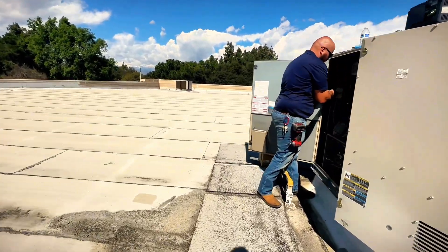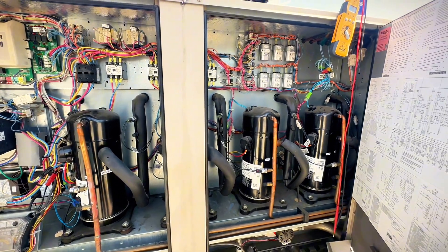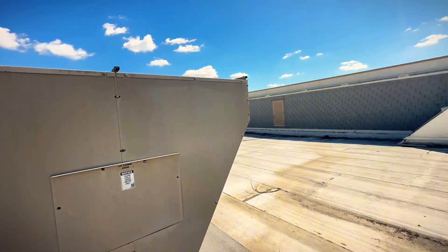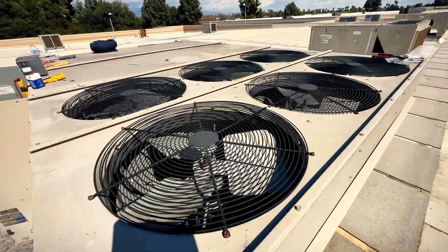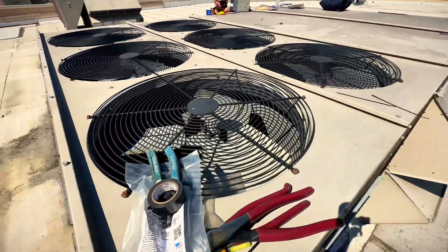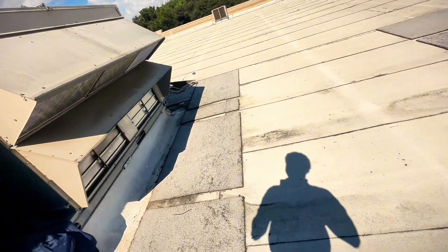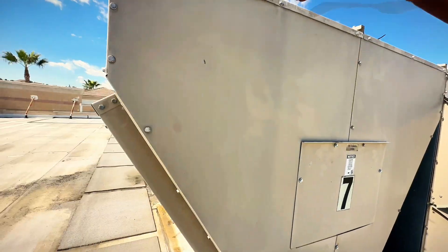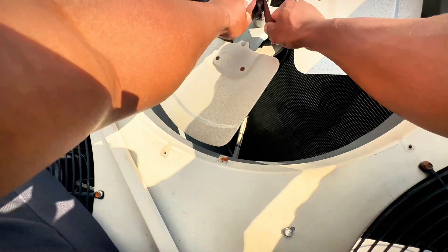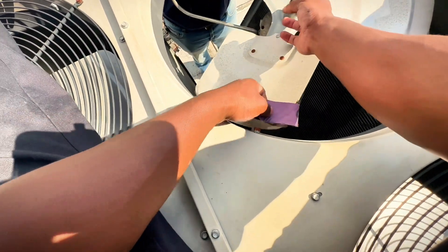I'm going to run one last test to make sure everything is great before we head out. Looking at this clip, you can see that the condenser fan motor we just repaired did not kick on — it was receiving a constant leak of power but wasn't running properly. After some troubleshooting, we found there was probably internal damage in the motor windings, causing it to backfeed and spin slightly even though it wasn't functioning normally. In short, we had an internal short in the motor and had to replace it to restore proper operation.